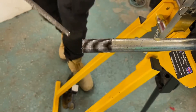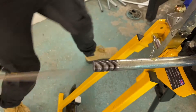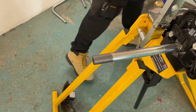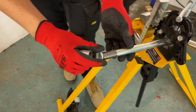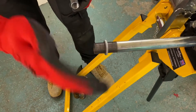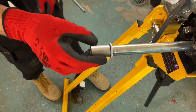The first thing we're going to do is debur this. Does it need a wipe? Get all that compound off there. So it goes ring first — you can use a locking nut or a locking ring, whichever you want. Sign of a good thread. So now when you bring the conduit back in they should still be flush, and we can wind this one onto the other piece. There we go.